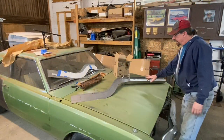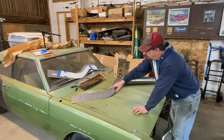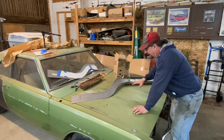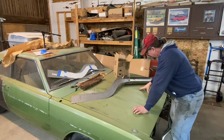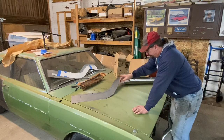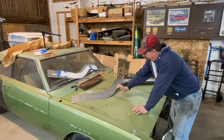So the next step then, of course, is to cut those two long pieces of straight that I need to put in the brake and bend them into the L pieces. Put them in the shrinker stretcher to match the contour of this. Make a cap that goes over it.